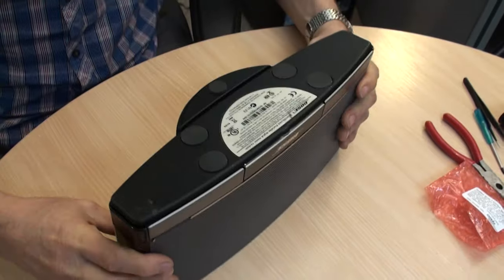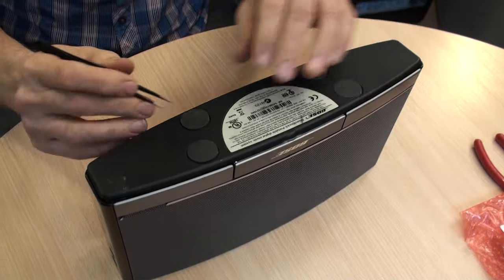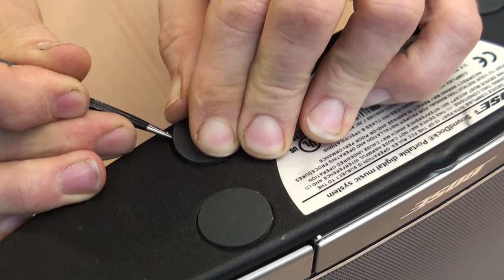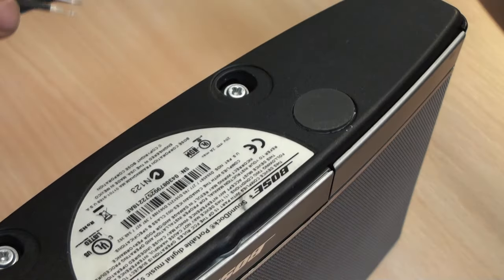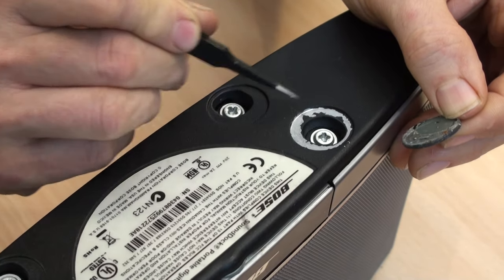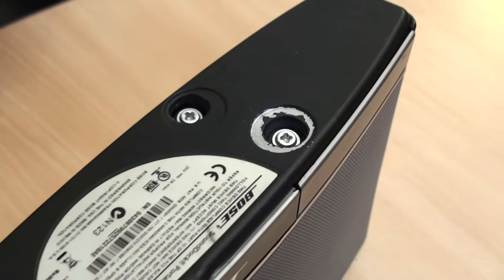That's the board you need to buy from the Invibo website. To begin, turn the dock upside down, stand it on the table, and remove the battery. On top you have four rubber covers — lever these off by gently pushing against the edge with a screwdriver or tweezers, peeling off the double-sided adhesive to remove the rubber pad. That will reveal four screws underneath. Note that removing the pad may pull paint off, so you may wish to add double-sided tape to the pad so it sticks back properly.